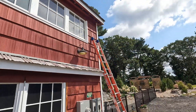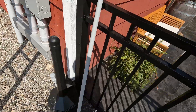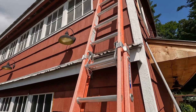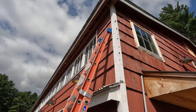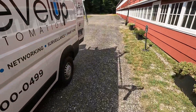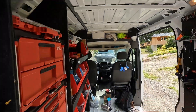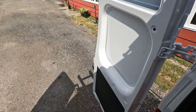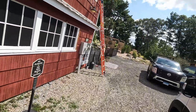This building is very old, and this is the only real point we have to run conduit to the highest point so that we can pair it back with that side. What I need to do is notch this little bit of overhang for the venting so that we can get a three-quarter inch stick in there and all the way up. We're running three-quarter inch conduit, which is our standard. We'll have a 90 on the corner and then an LB into the building, and then we'll put a J-box up top for the P2P system to connect to.